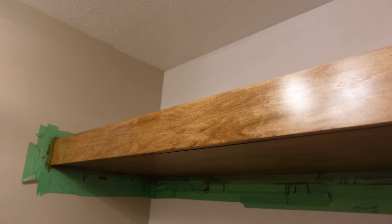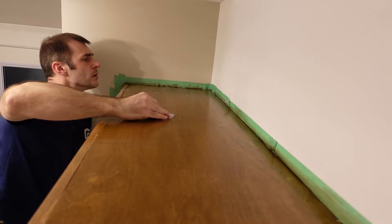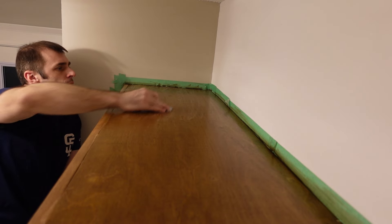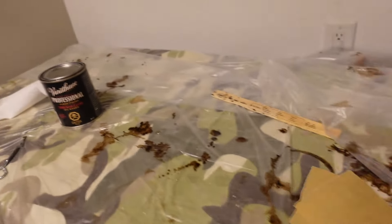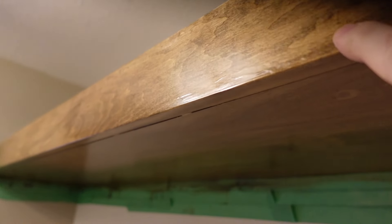You've got to work quickly and efficiently so it doesn't start drying up on you. That's what it looks like after one coat. Normally you are supposed to sand in between coats, although it says you don't necessarily have to. In the past I've used the palm sander on the clear coat, but I find it can get a little bit aggressive — you don't want to burn through the clear coat because then you start removing some of the finish underneath. That's what it looks like after the second coat of clear coat. Before doing the clear coat, I let it sit again for about six hours — if you don't let the stain set, you could get the stain getting picked up into the clear coat and making it look hazy. After sanding with 320 grit, that's what it looks like after a third coat. I messed up on the front a little — got a bit of a run — so I re-sand it lightly and do another coat of clear coat.